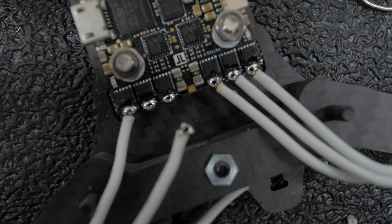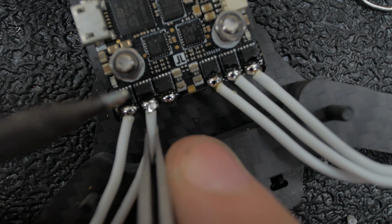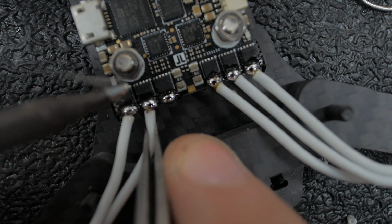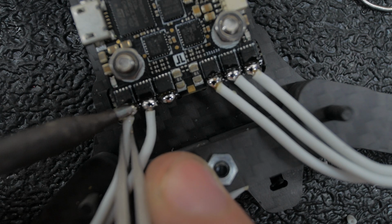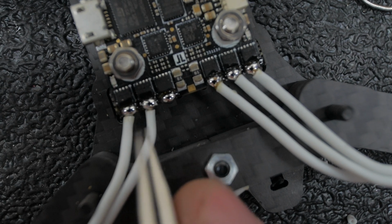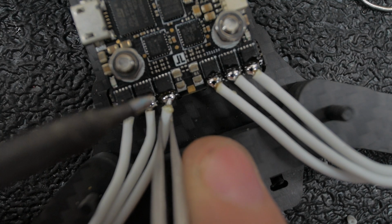A little bit too much solder right there. If you see, they keep wanting to jump. So I'm happy that problem I actually just showed you guys. Some people panic when they're in that moment, so I just kind of wiped it off and retried. Cleaned this one up, and now they're good. Don't panic if things ever jump together.